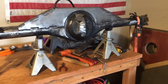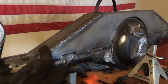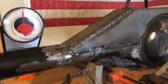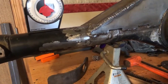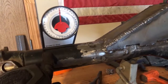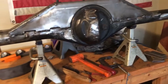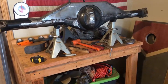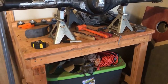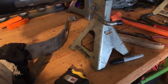I've got her mostly welded up — at least the top truss. The ratchet straps seemed to do the job; I'm at zero degrees on both ends so there is no bow. I'm not sure I'm on a perfectly level surface, but my next step is to weld the bottom plate on.